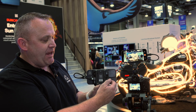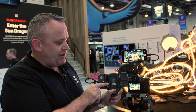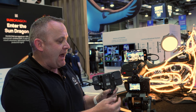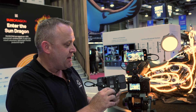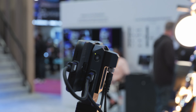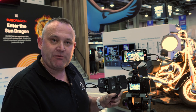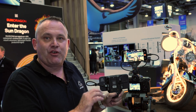The interfaces are HDMI in, uncompressed encode, and then video out from that encoding. You have a USB-C power input if you want to use AC power, and a microphone accessory USB-C for your microphones. So that gives you three USB-Cs plus the HDMI. You've also got the power button here that indicates how much battery time is left — it flashes orange, amber, and red, then flashing red when you need to change the battery. A lot of really high-quality interfaces that let the Ninja Phone control the quality of what's being input and recorded on the phone.